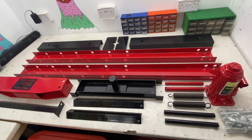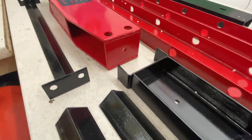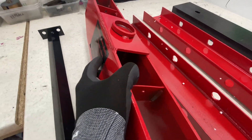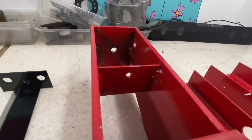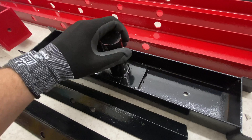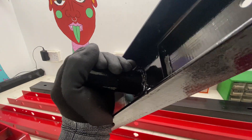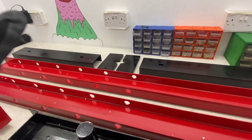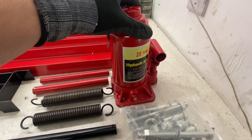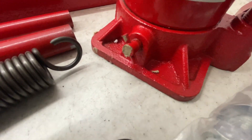So here it all is and for what I paid, I'm just going to say reasonable. First impressions, welding-wise there's some definite mishaps — the more you look the worse it gets. However, this is the pressing part and as you can see it's pretty thin stuff already, though it looks like there's a nice bit of strengthening there. It's supposedly 20 tons. There's some square blocks here and I have bought some new ones which I'll show you soon. The hydraulic jack doesn't give me too much confidence — it's pretty rickety and absolutely everything has been painted.